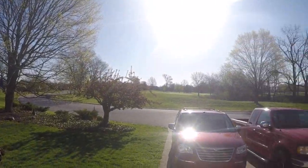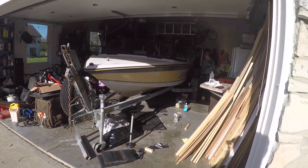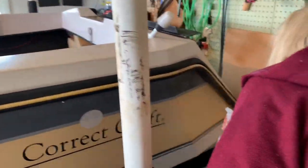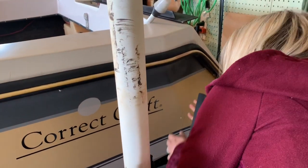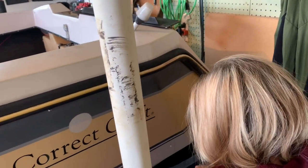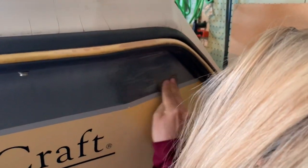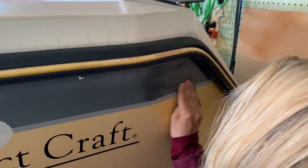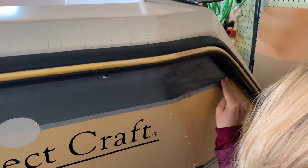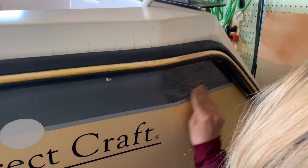It's going to be a beautiful day today for some real boat work. We're going to sand this whole thing down. This was my first time ever wet sanding a boat to remove the oxidation off of the gel coat. You need wet-dry sandpaper — I found it at my local O'Reilly's Auto Parts. I got 1500 grit and 2000 grit sandpaper. Fill a water bottle with water and a couple drops of Dawn dish soap and always keep the surface wet. It probably took me about 16 hours in total to sand the entire boat.